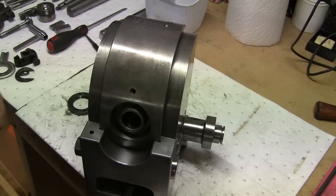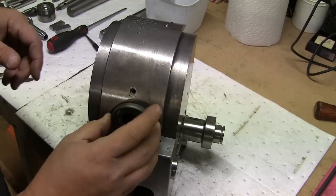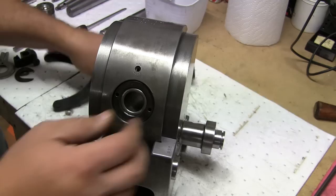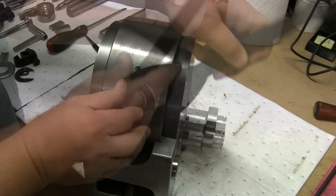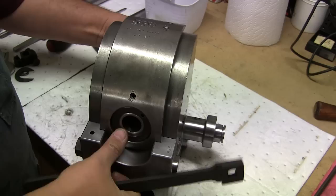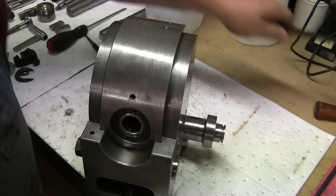Now we've got the back part to do, and this is where that ring comes in with the oil grooves in it. So this guy goes back here. We have a simple spanner nut. Now that stopped tightening down, and I think this little bit of end play is for the mechanism that engages and disengages the spindle with the crank. So I'm going to just leave it right now the way it is and move on to the next step.